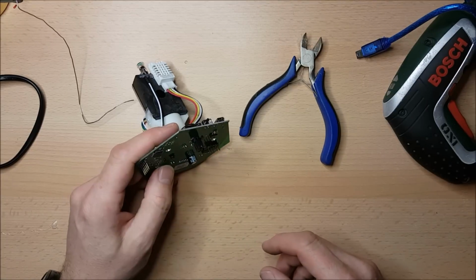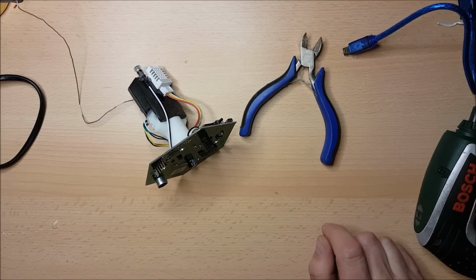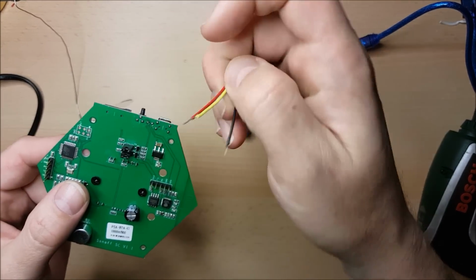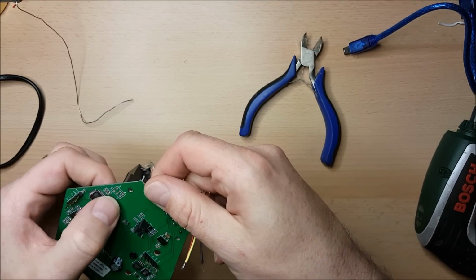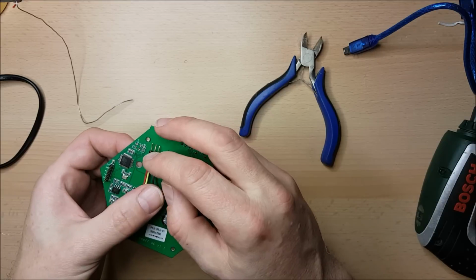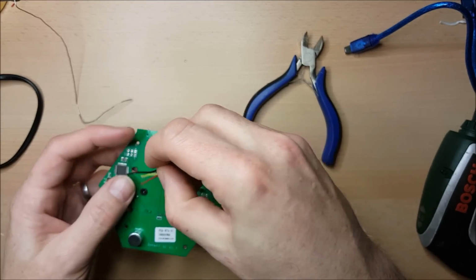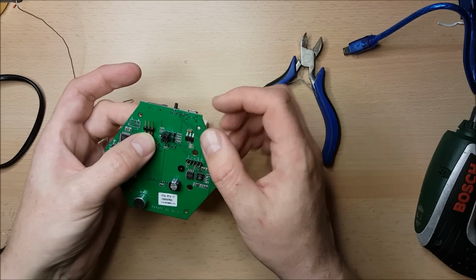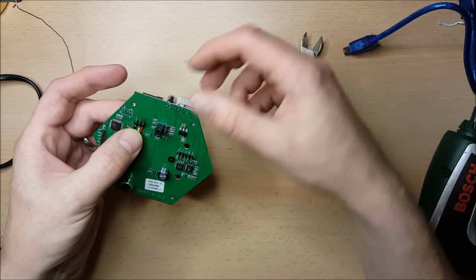The next thing that we're going to do, and I've pre-prepared this, if I can find whereabouts on my messy workbench I've left it, is this. I don't have enough space to put a header on these pins. These pins are on the controller, but they're also connected to the SD card. So what I'm planning to do is attach this little header to the terminals here, solder it on and then hot glue this onto my board here, like so, so that I can easily plug in the DuPont connectors from my LED light ring.